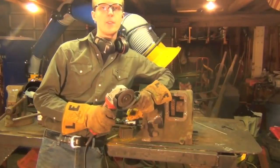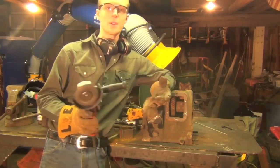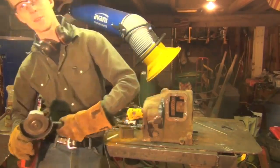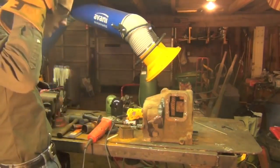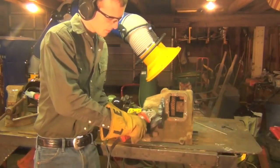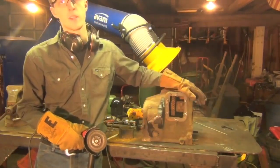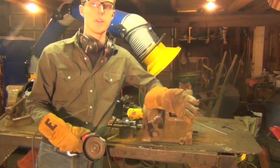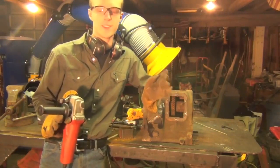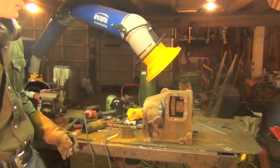Alright ladies and gentlemen, so you now know what the sparks that come off this transmission casing look like, and so now I'm going to take the grinder to the table here. If they match up, you're in luck and you're working with cast steel - a lot easier to weld, all these problems with cast iron that we're talking about are not your problems. But they're definitely a lot different, and that's because this is what appears to be gray cast iron. I made an entire video on spark testing if that's something you want to learn about. This is definitely cast, and gray cast is not the hardest type of cast iron to weld but it's also far from the easiest - it's not very forgiving - and it'll provide a good medium for me to demonstrate this for you guys.